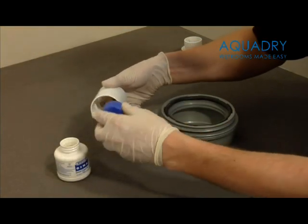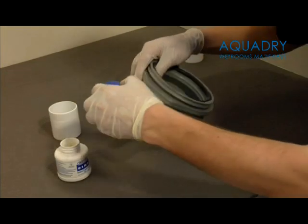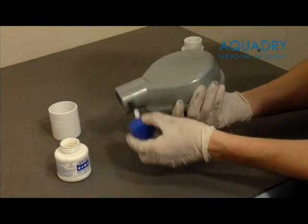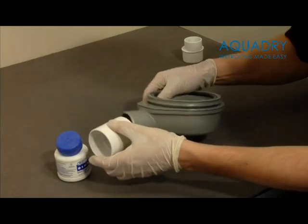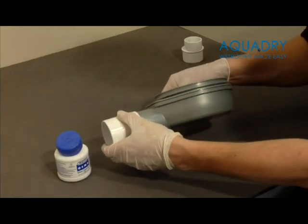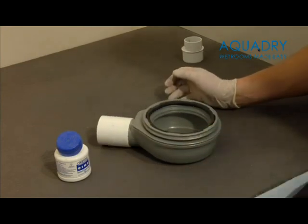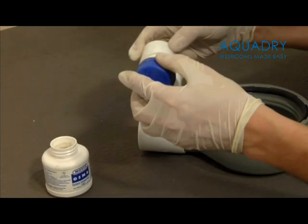The waste trap and fittings are all solvent weld products. We recommend that you keep all pipes and drainage parts clean at all times, and that they are cleaned properly with the appropriate solvent waste pipe cleaner prior to connection of all the fittings. After cleaning, apply the solvent weld adhesive as shown. The pipe moulded to the trap is a 2-inch standard solvent pipe and has a built-in 3-degree fall.